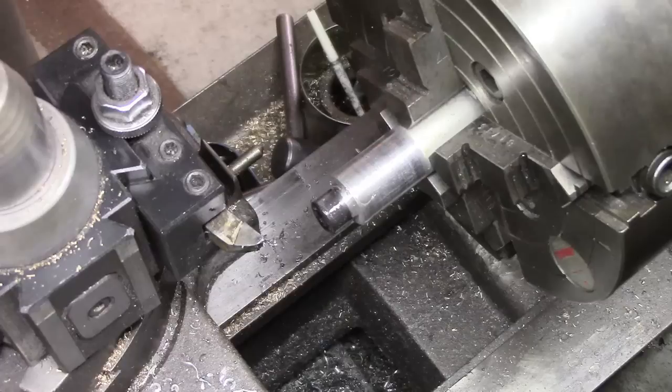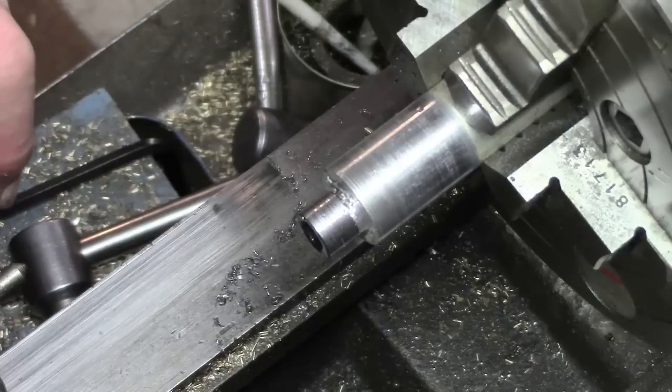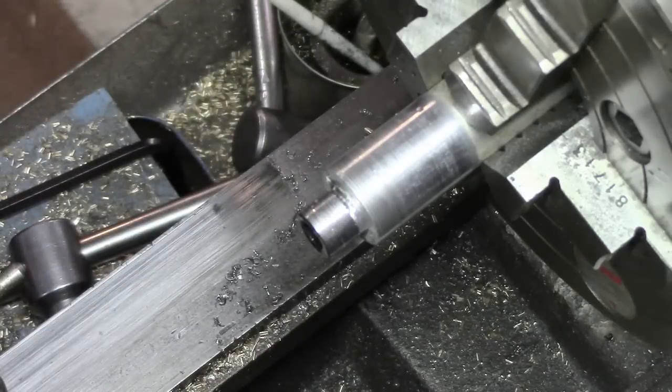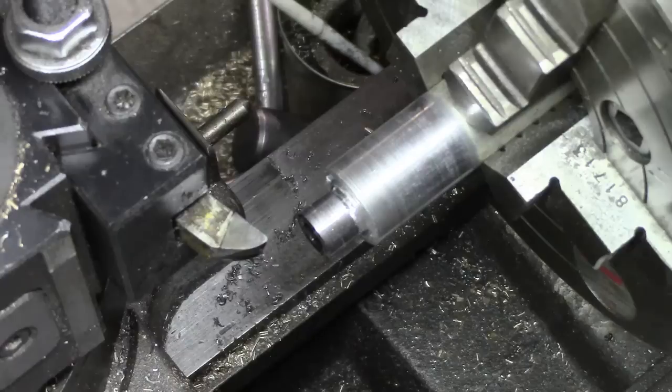Anyway, I won't bore you with this all the way through. I'll get down towards near the end of the cut and come back to you. Well, this looks a bit safer on the wall thickness, as long as there's enough camming effect, which I hope there will be. If not, I'll have to try another bit of extra offset. This should be the last 2.5 thou to get down to 430. No, 435, which should be just clearance in the 7/16 when the end mill's done its work.